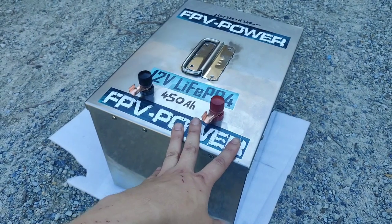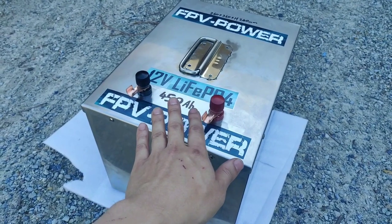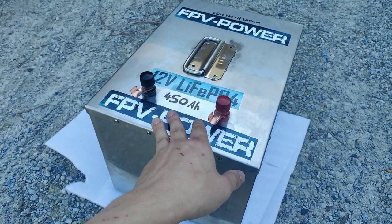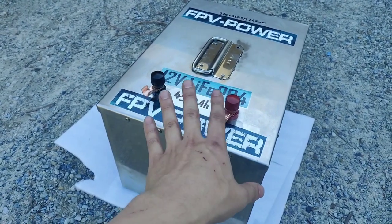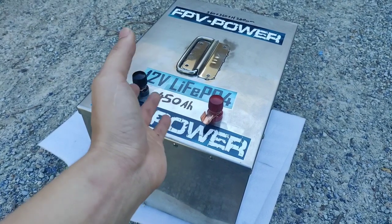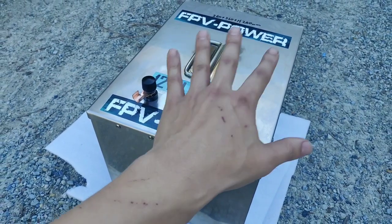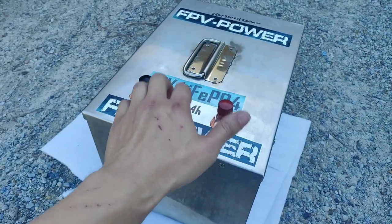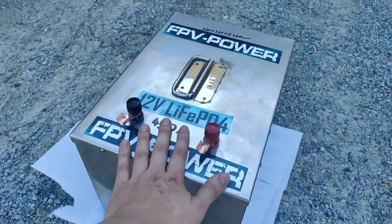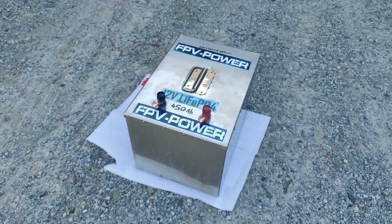A coffee machine in the morning, and at the moment he can't do it with his lead acid because it's too much power. When you're converting, let's say his coffee machine, we looked at it last time, was 1,200 or 1,400. 1,400, so 1.4 kilowatts, 1,400 watts. You divide that by 12 volts, and then you're looking at about 100, maybe 120, 130 amps or so. So with that, we had to have a battery management system that can handle that high amperage. So we've got one in there that can handle 200 amps, and we've used heavy duty copper core wire cabling inside that can handle the high current. So everything is made for a specific use. So that's what we've done as well.